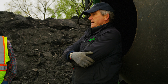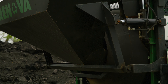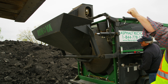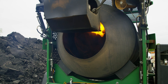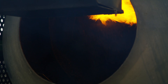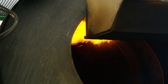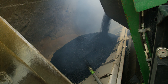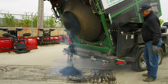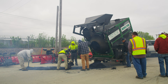You don't have to drive to the plant either. We can put chunks in, put millings in — the design is to recycle asphalt. One important feature is the ability to reheat: once you make your load, you can take it from site to site and heat it up as many times as you want, as long as you keep it under 340 degrees. One way to use it is to park it next to your pile of millings and fill the hotboxes. Another is to take it to the site and drop it right in the hole, in the wheelbarrow, or shovel it out. The first batch takes 30 minutes, the second 20, the third 15.